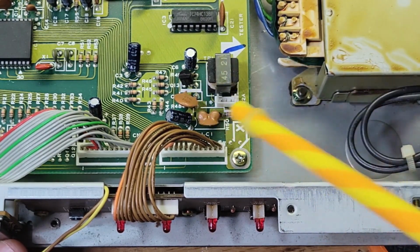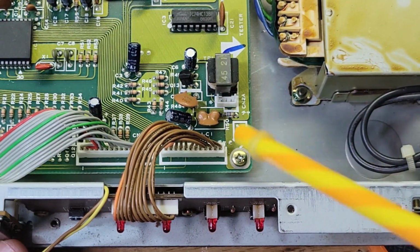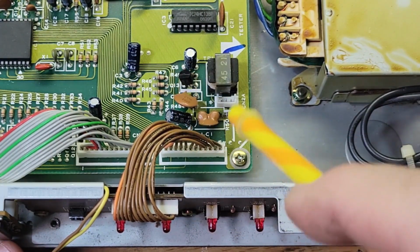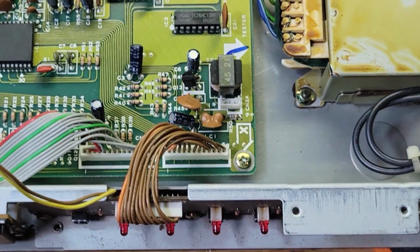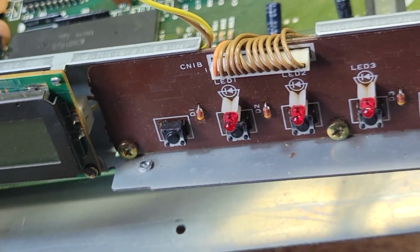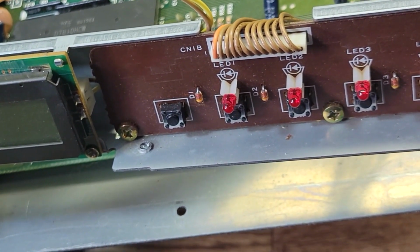We're going to check it on the scope in a minute because it may not be a perfect sine wave, and it may not be centered around zero. The peak-to-peak voltage could be higher, so we'll check it just to see. I think that's what they're doing here, inverting it. This connects to there, and you can see right here it just goes into the actual LCD where the backlight plugs in. So let's hook it up to the scope and see what we get out of that connector.